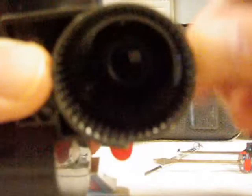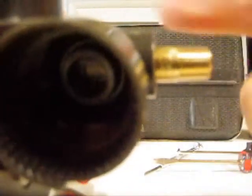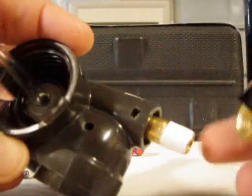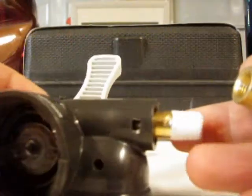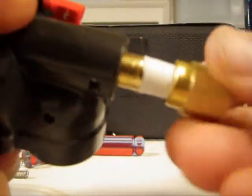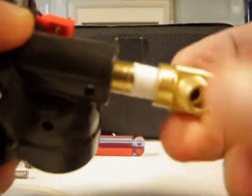You'll start to see the Teflon coming through. If you leave that last thread open as you go in, you can actually see if you've completely sealed the opening inside — because if all you see is Teflon with no brass threads left open, you know you're going to close off this bottom. I've done the same technique to the other side, placing the Teflon tape on and wrapping clockwise, much the same way, so as I rotate on, it won't bind up.